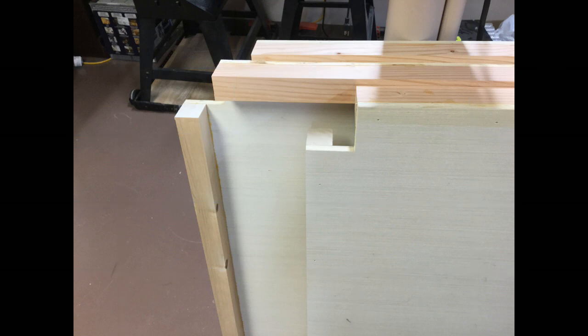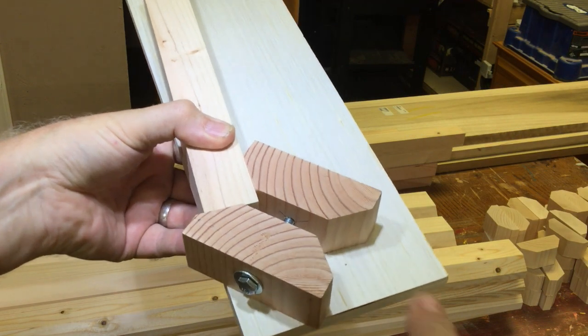Once you do that, you're ready to glue the supporting materials — those two-by-fours that you ripped down the middle — and you want to do it so that it is just the same size as the edge that you're gluing it to. I simply use wood glue with clamps and a brad nailer to assemble these things. You could use screws and glue — there are different ways you can go about doing it. Once you have the shelves ready and you've done your work with the corner posts, you're ready to make the wedges to cinch all of this together.